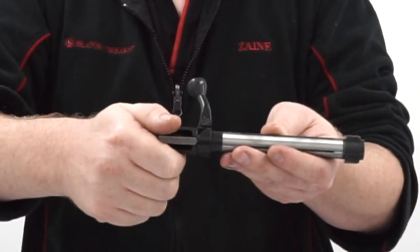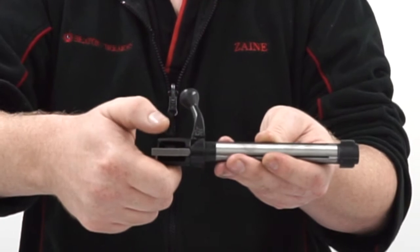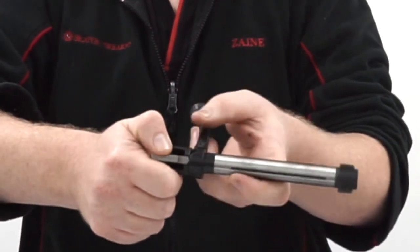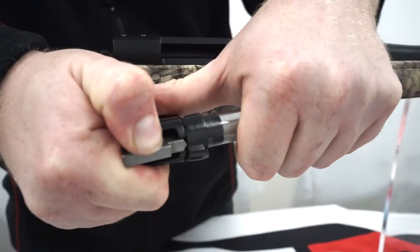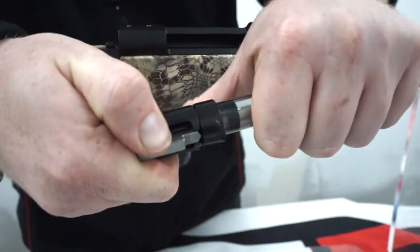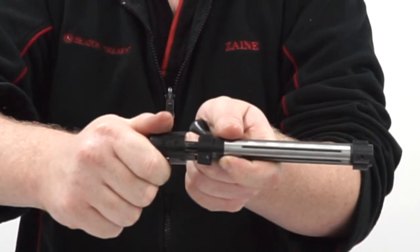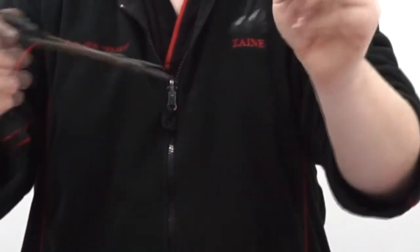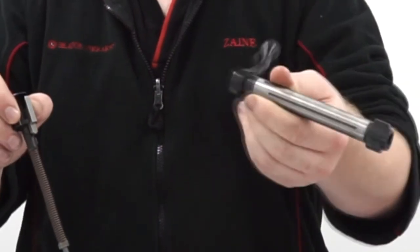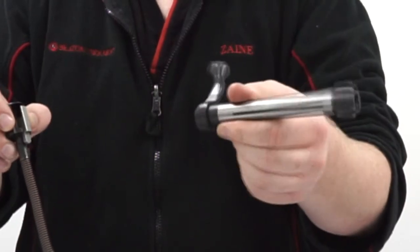come forward. To take it apart, you rotate the bolt shroud in the opposite direction. So I'm going to hold onto the bolt handle and push the bolt shroud in the opposite direction. It takes a little bit of pressure to do it, but I've rotated the bolt shroud around, and just keep rotating it around until it pops out, like that. And that allows you to remove the firing pin mechanism from the bolt. So that's the bolt with all the firing pin and everything removed. You can clean that out with Shellite, white spirit, something like that.